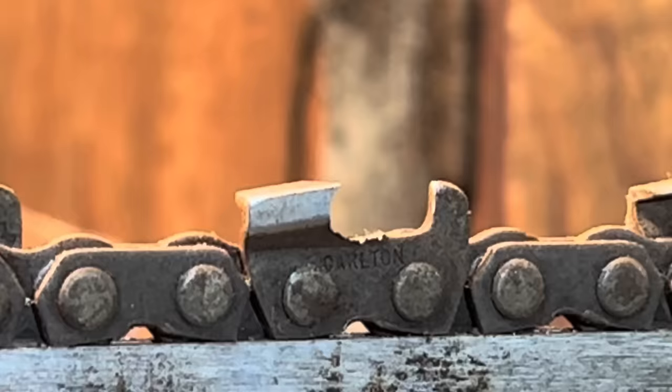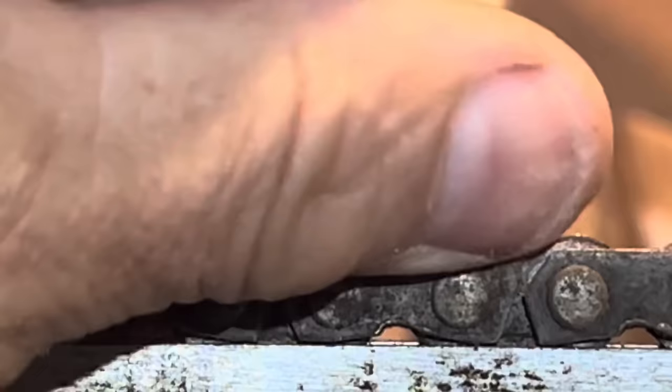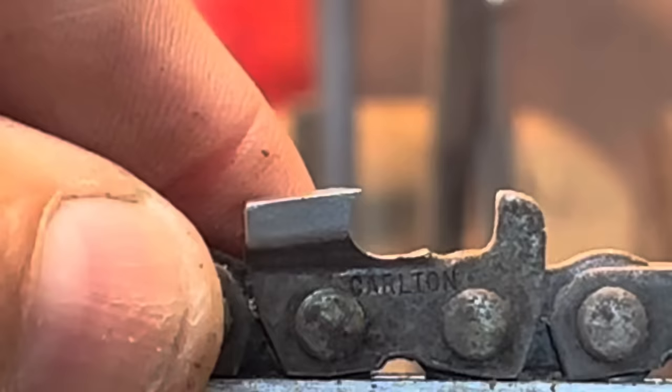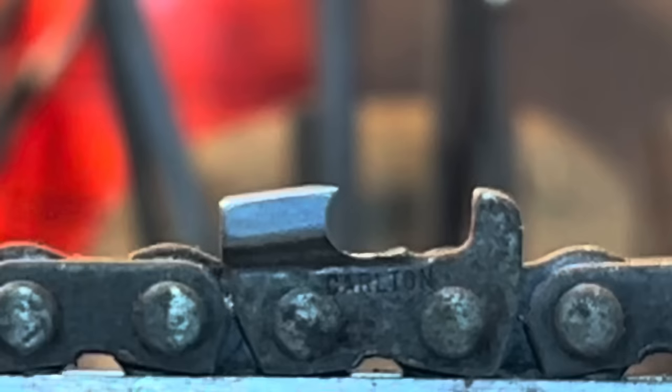There she be. But to be honest, it all depends on what you're cutting. Normally I prefer this - now I'm just going to go down a couple. There you go - that's what we get. So this is what you're after, friends. You can still see - there's nothing wrong with that. That's very respectable. But you can see - this is gullet right here. So that is a very acceptable, nothing aggressive. That is where I live usually, with a lower raker.